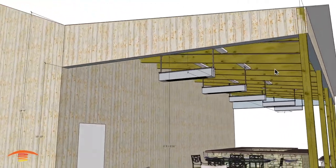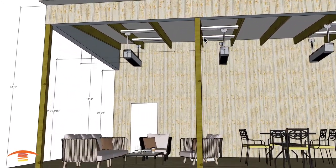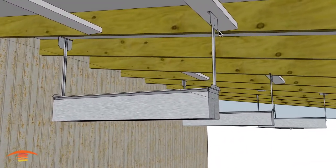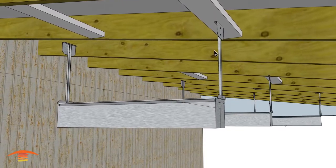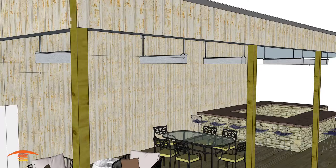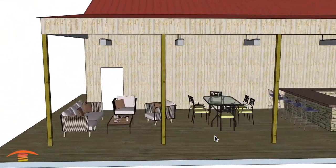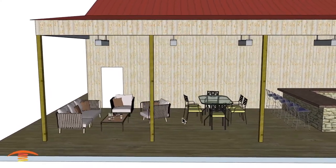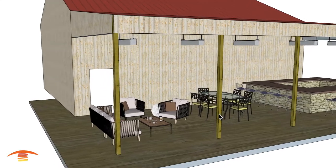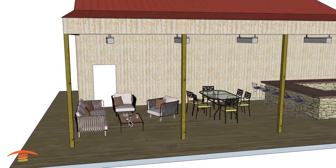I think I have these rafters in approximately the right position. We'll use the bottom edge of the rafter as the clearance point — minimum 14 inches from there down, or use the maximum bar length or further to get a better heat footprint. This is a colder climate, so you really want to get as much heat as you can on the seating area. This will extend the outdoor season, but when temperatures drop into the 50s, you probably won't have enough heat for very cold climates.